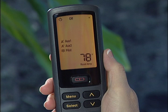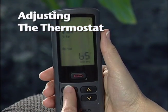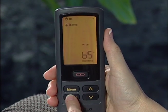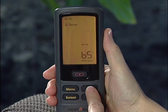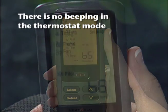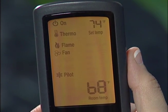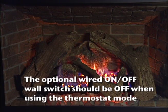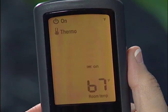AUX1 can be accessed when the flame is off from the remote's off mode. To adjust the thermostat, press the menu button, highlight the thermostat icon, and press select. Turn the thermostat on and press select again. When the thermostat is on, press select and the set temperature will start to blink. Set the desired room temperature and press select. Once the thermostat function is on, the set temperature can be adjusted at any time by pressing the up or down arrows. As the room temperature nears the set temperature, the system will automatically adjust the flame height and turn the flame on or off. The system will remember the previous temperature when thermostat mode is cycled on or off.